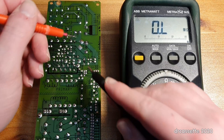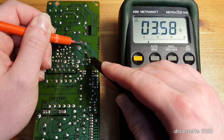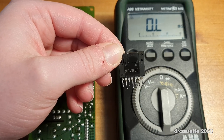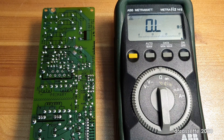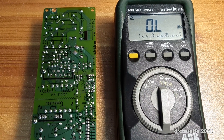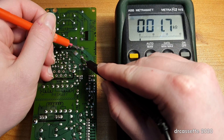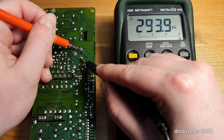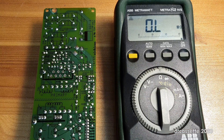Let's once again measure resistance across the main filter capacitor — as I said, 3.5 ohms. I now have the MA2830 removed from the circuit. Let's see if that has cleared the short circuit. Repeating the resistance measurement across the filter capacitor — the resistance is rising, it's now in the megaohms range. So the short circuit is gone.